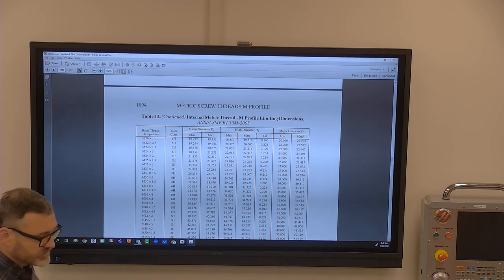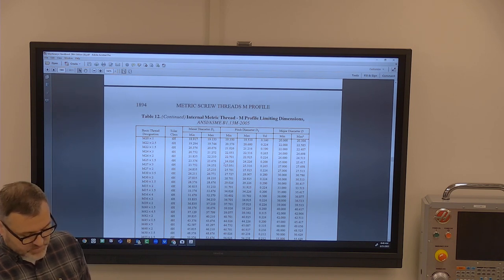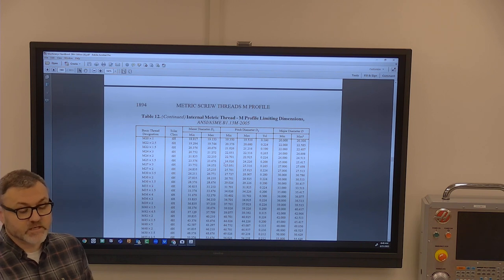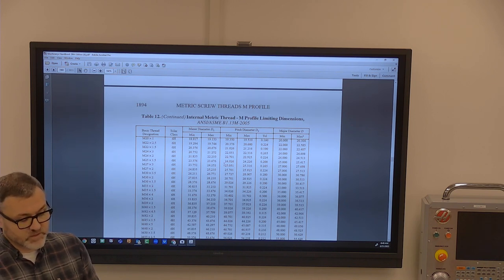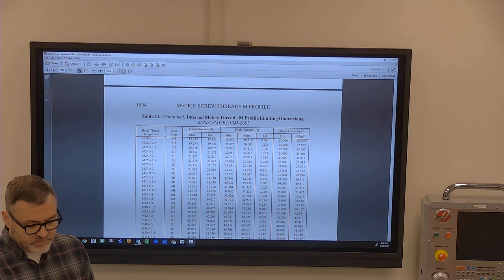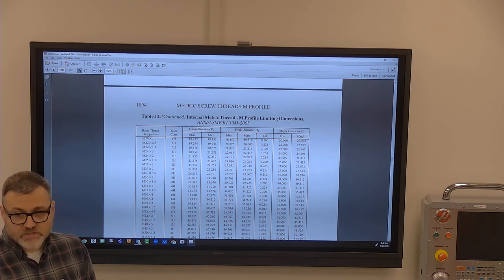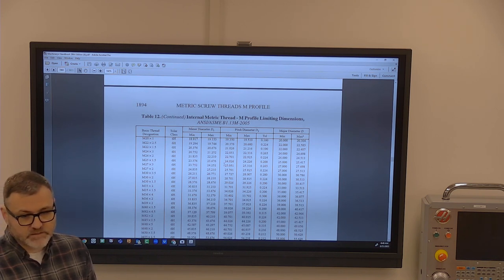And so if you have this interchangeable anvil-style micrometer, my suggestion is to bring it down close to zero. And then all you do is, there's a little ring on it. It goes into a groove. You just push it into the hole, and you'll feel it bottom out. And then go ahead and put your smallest rod on there. And then from that point on, you can bring it out. And you should see that rod move or spin. It may not spin, but it should definitely move back with it.